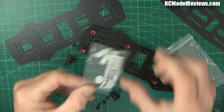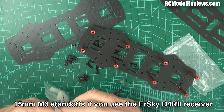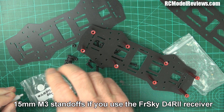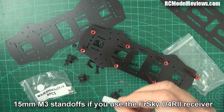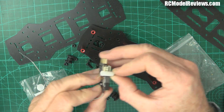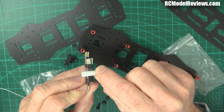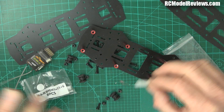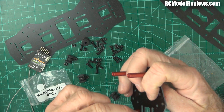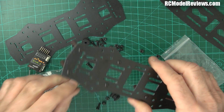I showed you in the first video - here they are, plastic standoffs. We need to look at what size standoffs to use, because I'm using the FrSky D4-R2 receiver, and I'm pretty sure these standoffs are just the right size for that receiver. What we're going to do is slide the receiver under the Mobius platform - if I make my standoffs long enough, I can slide the receiver under the flight controller platform. You could put them through like this and put a nut on the back, but that's going to be a bit long and bang into the other board.